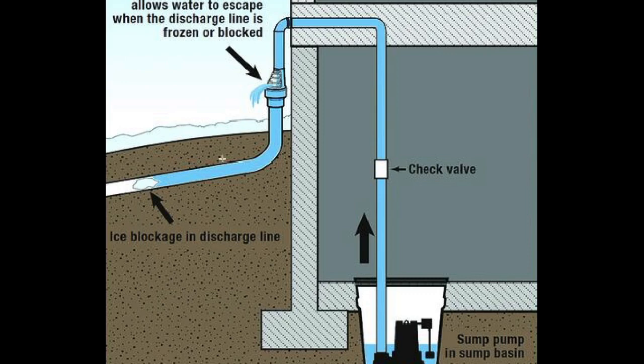All the pressure and blockage will be upstream above your actual adapter, not down here, because pressure is not making it to this point — and that is because you have this opening right here. However, if this is completely blocked and this adapter is not installed, that is constant pressure building as the sump pump is trying to push water out of the chamber, upstream and out of the house, and you are going to burst a pipe or burst a check valve and have a bad day. That's not what you want as a DIYer.